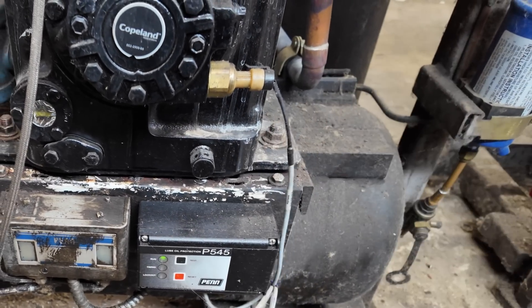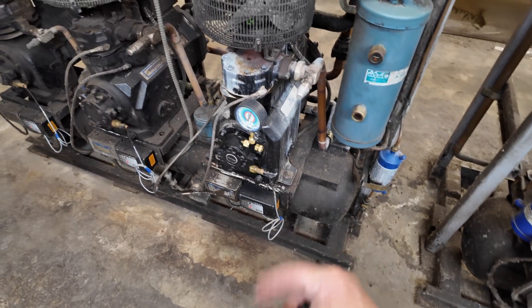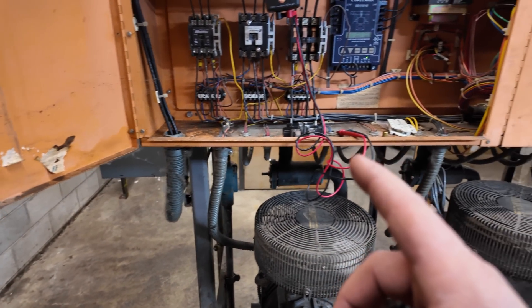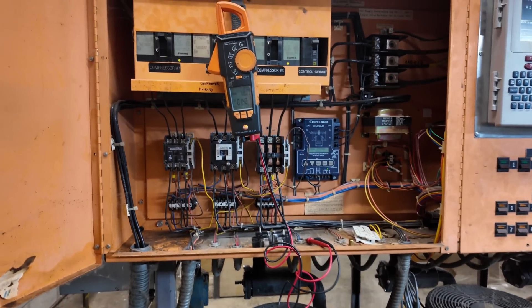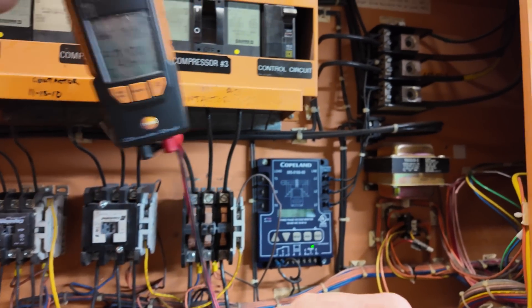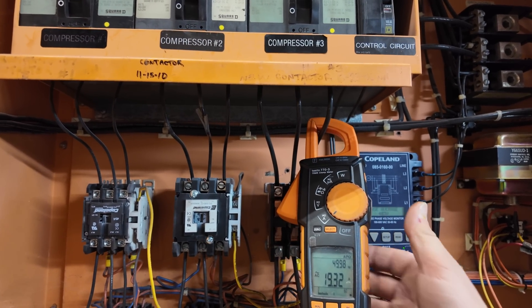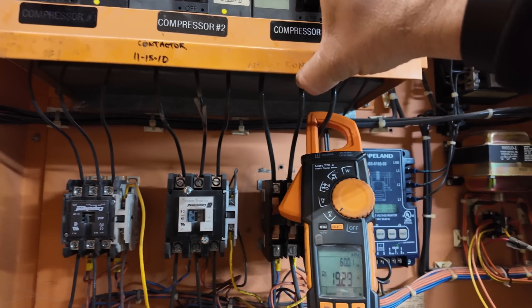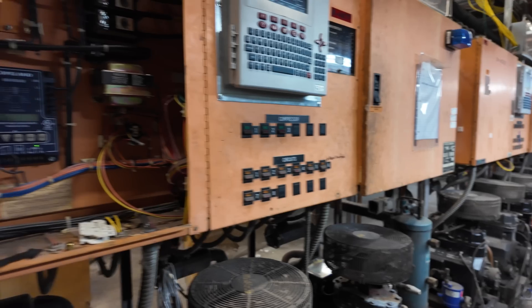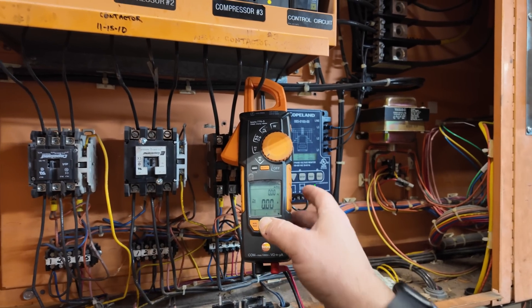So we're waiting on our switch to see if we've got a trip here. But like I said, what really caused it was when that compressor didn't pump because it didn't have a breaker working. The issue would have been the fact that it didn't have a differential because the breaker was actually tripped. But the compressor is not pulling stupid high amperage. We can stop it and go into inrush — we can compare inrush to the actual locked rotor and see where we're at there.